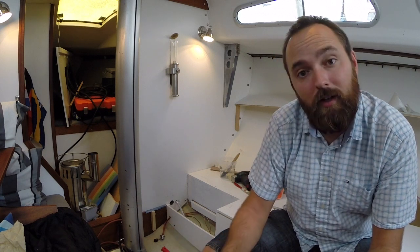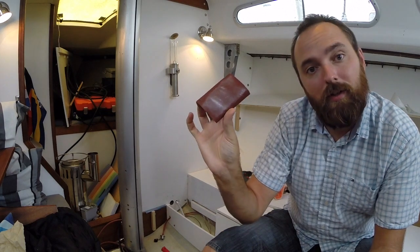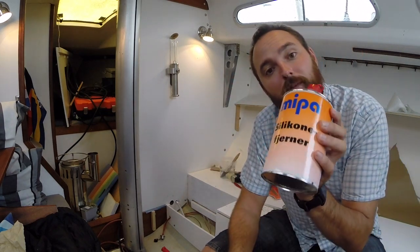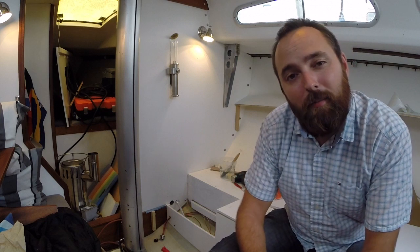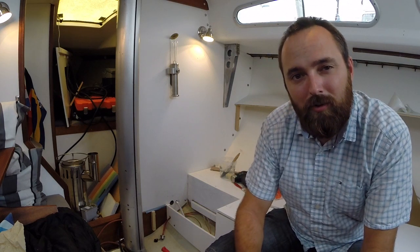I'm back aboard the boat to put on the second coat of paint. Before doing that, I'm just going to knock down any high spots using some 120 grit sandpaper, and then I'm going to wet the surface with some grease remover. I haven't cleaned up the area down below in the boat after removing this piece of the bunk, and the cabin sole is pretty much littered with sawdust right now. But I'm not too worried about that, because even if some dust particles should settle in the paint, I still have about four or five coats to apply. Before doing the last two coats, I am going to do a thorough job of cleaning the entire boat down below — that way I'm absolutely certain that I'm going to get the finish that I want.